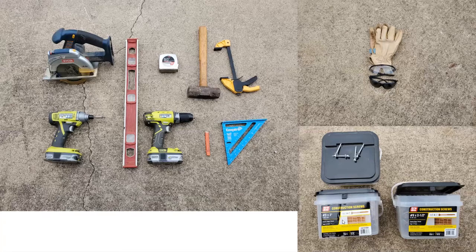Three-inch screws we used for toeing in on the roof to secure it to the main frame of the building. These on top of the bucket are known as sheeter screws. For corrugated tin, you don't want to use roofing nails — sheeter screws are meant for corrugated tin. You can see it's got a screw, a little washer, and a rubber grommet underneath it, with a hex head. It screws down and that rubber grommet squishes down to basically form a water seal, so you're not getting leaks through where you put your screw through the corrugated tin.